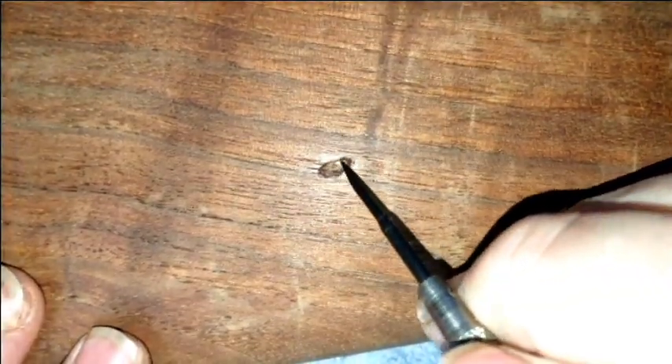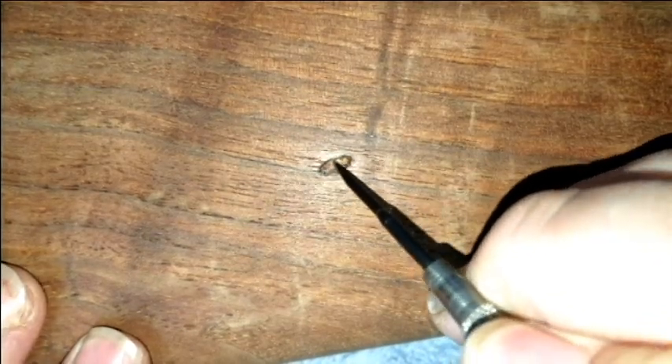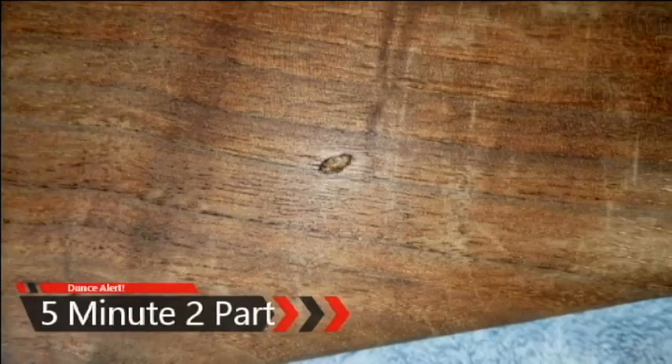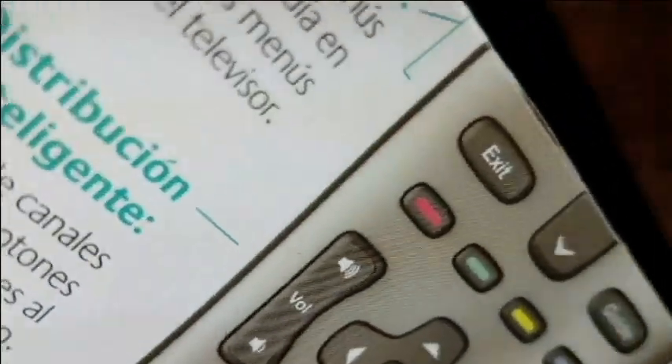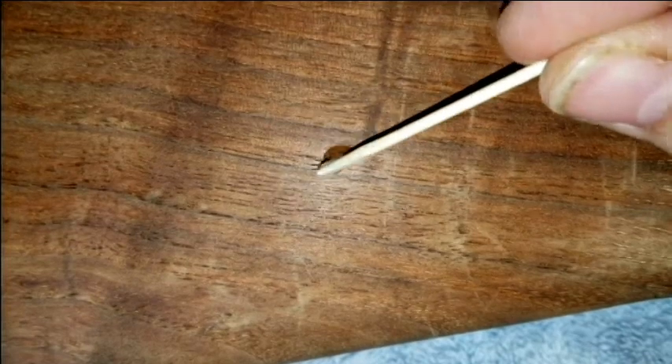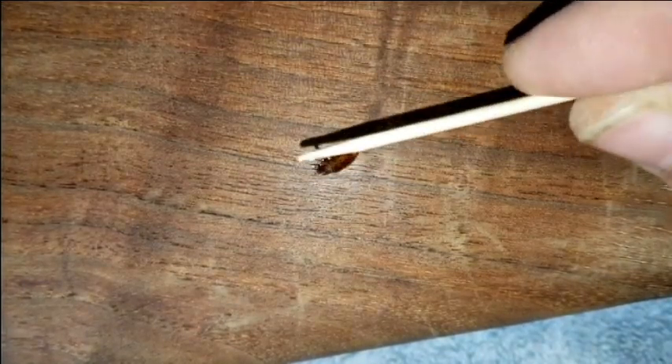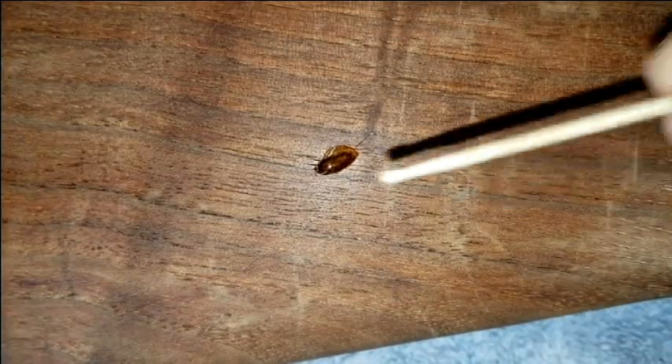Okay YouTube, back to do some filling on this little imperfection in my stock here. Go ahead and rough up the bottom of it a little bit to make sure there's going to be some good fresh wood for the epoxy to stick to. Now I've got my five-minute two-part epoxy here that I already mixed up because this is fast-acting stuff. All you're going to need is the two-part epoxy — I use the five-minute stuff — and some masking tape. You're going to lay some epoxy in here.